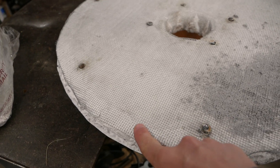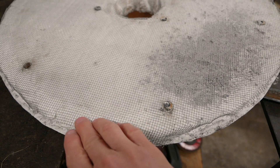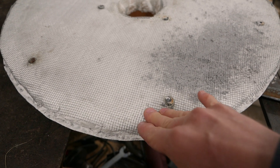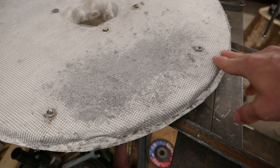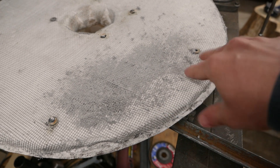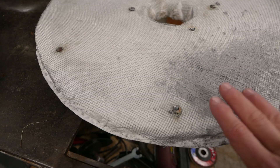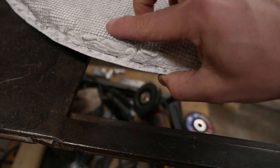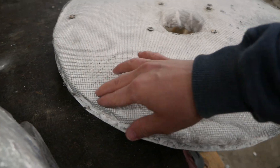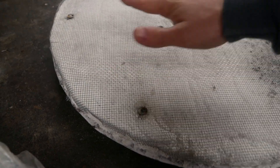And also what I did was around the edges, I soaked in some sodium silicate — water glass. This stuff hardens up when it cures with, I think, carbon dioxide in the atmosphere. It kind of dries and then cures. It's given some rigidity. It's still a little bit crumbly. The idea was that it would give it a little bit more stiffness where this lid rests on the bottom.